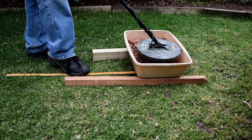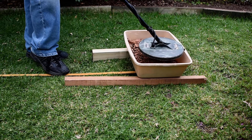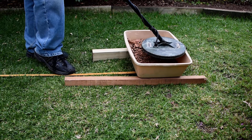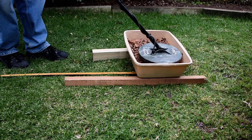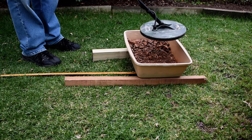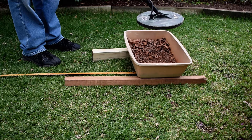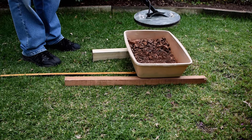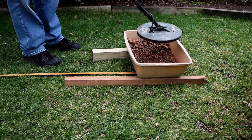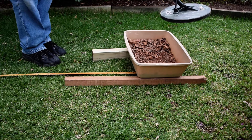You can hear it quite well — it's probably a good six to seven inches above the target. As you can see, it's punching through that really hot ground at a good depth with a good signal. I'm really using fairly benign settings — threshold A of 40 and null, gain of 4. I would call those middle-of-the-road settings. I could push it up a lot better than that, but I'm trying to show that a good PI should pick out stuff through really really hot ground.